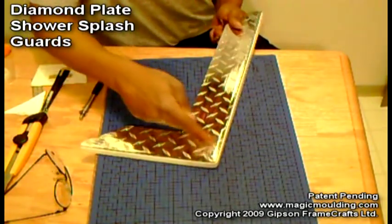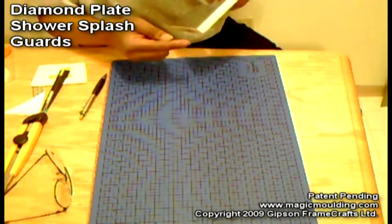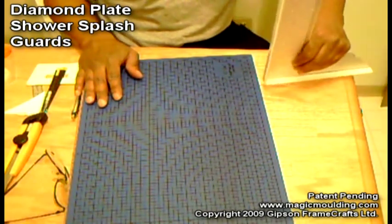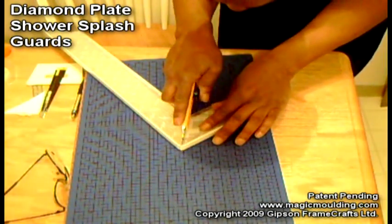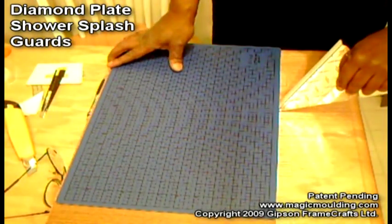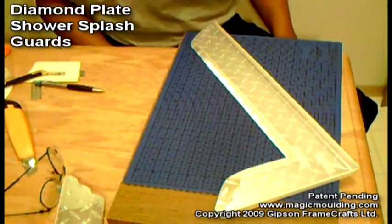We've got to cut this because we'll still need to overbend it when it's installed. The key to getting good results from a shower splash guard is this point right here needs to get right into the corner in the grout. With most shower guards on the market, they're shaped in a perfect 90 degree — and how do you get both pieces to stick? You either stick it to the wall first or the tub first. I think it's important to stick it right on the grout first. If you can't stick it on the grout first, you don't get good adhesion down there. So you need to fold this over when you install these things in order to get right down onto the grout, then put this side down, then this side down. That's the way it's done. I can't wait to see this installed — I'll have to take a photograph once I do.